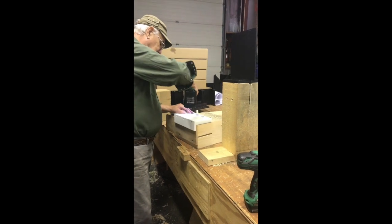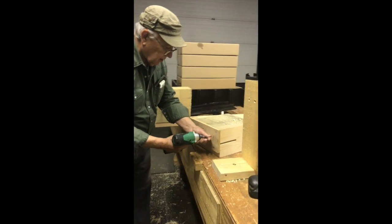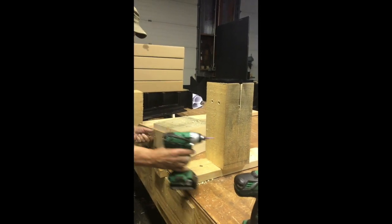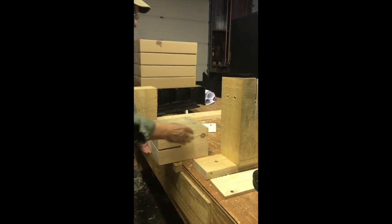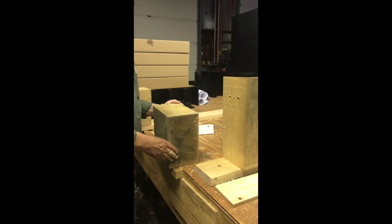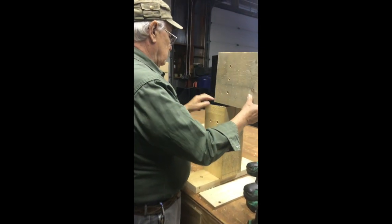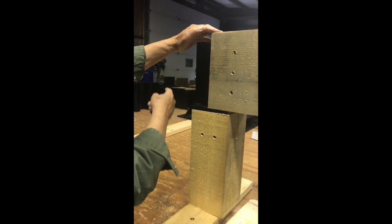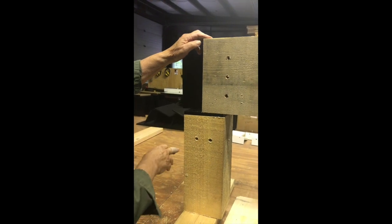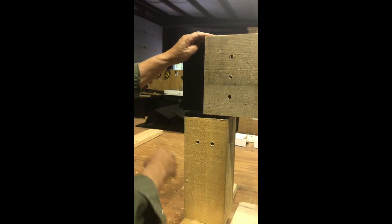Now we've got the holes where they should be — I've already slotted this one. I'm really trying to demonstrate how the three-way connector works, but I can't miss an opportunity to show off my new pro slotter. I'm going to slot this stubby part just to show you how well it works. This piece is going to go up here to the center of the beam, get pinned, and then you do exactly the same thing with the piece on the other side. This is a knife plate connection — one plate gets three pins here and three pins on the piece coming in, butting end-grain to end-grain over the vertical post, tying this whole thing together with one plate.